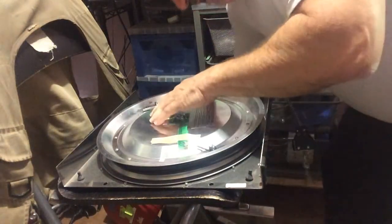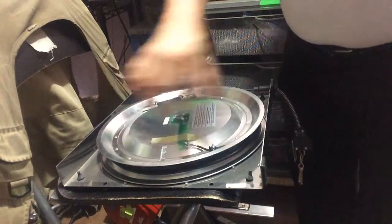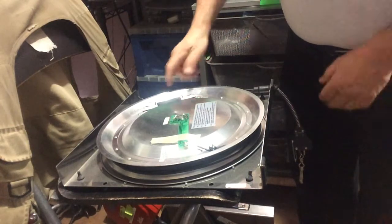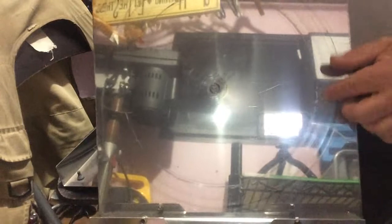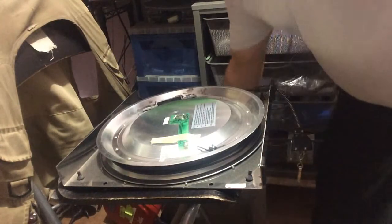So we have a big drum here — a very, very large drum, which means the cable isn't bent really tightly. This is the brake right here. It's very, very loose, so when the wheel's spinning around quickly to retract, it flies up and comes into contact with the underside of the lid. You can see the lines right here where it rubs against the lid and slows things down so it doesn't slam back into the housing at a whole lot of speed.